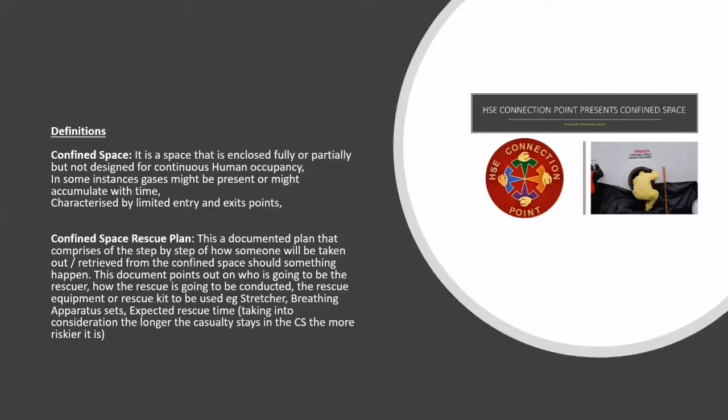All right, cool. I was saying the reason why it's regarded as a confined space is due to the low point of the ground that you have created now. If you dig a trench, all the vapors that are around, because vapors don't go up in air, they find the lowest point of the ground. That's where they hide themselves. So if you are in a trench, that's where you possibly find your vapors. Hence, they regard that as a confined space, even though it's partially open, the roof is open, but it's still a confined space.